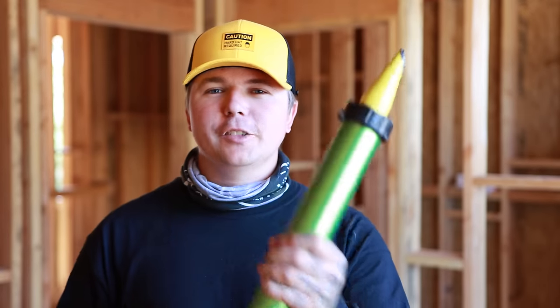When you're using the liquid flashing, it takes around 30 minutes to skin to get a hard texture on the outside and 4 hours to dry. That is why my favorite method is using the regular old flashing tape and then hitting the sides with some stretch tape. Works great, and along with that, just stretch tape from end to end. It's a great method. You can set a window right afterwards. There's no wait time, which is probably my favorite thing about it, and there's no mess.